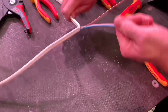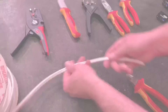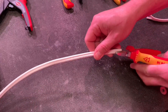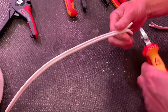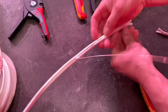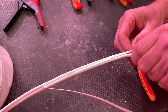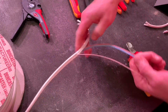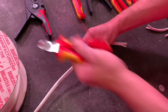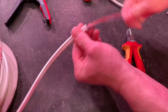Peeling it off the conductors can be difficult — there seems to be a generous amount of chalk in there, which is a sign of a Doncaster cable. Now removing the knife and doing the traditional side-cutter-only method: splitting down the middle and pulling the CPC down to the finish point. It's a little bit more difficult without the knife, and breaking it off is trickier. As far as we're aware, it's only Doncaster cables that put the groove in — everybody else relies on running the knife down the middle.